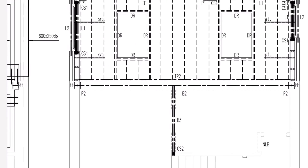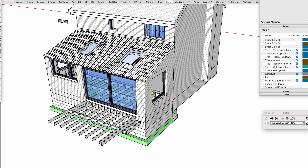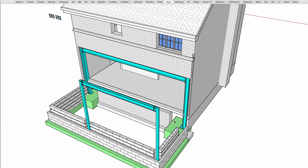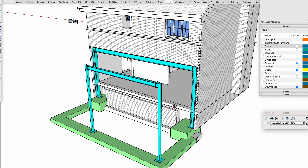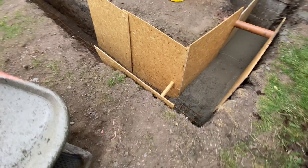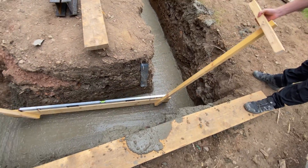The engineer decided the existing house walls are not strong enough, so as I have a large glazed opening we also have some steel to create a big lintel over what will be the patio doors — the sliding patio doors — which is what this smaller goalpost arrangement is. In the new build part of the extension the steel columns are bolted into the concrete foundations with resin anchor bolts; we just drill some holes, put the bolts in, and inject some resin. You can get these from places like Screwfix. I'll leave a link to how I poured these concrete foundations.